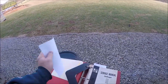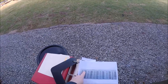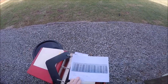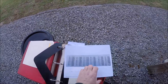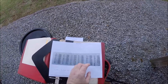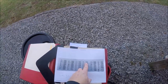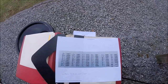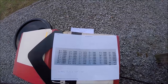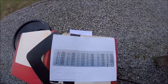Going back to the letter at the end of the serial number — what Hyster did starting in 1957 is put a letter to designate the year, going out through the years. They did not use I, O, and Q. So when I was looking at this forklift, I brought my iPad and looked it up. The B — I thought this was a 2004 model, but no, actually this is a 1981 model. It's actually older. You can find it on the internet; sometimes you have to search a little harder. This is how they lettered it to the corresponding year.